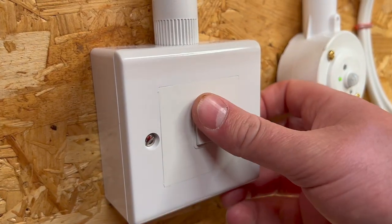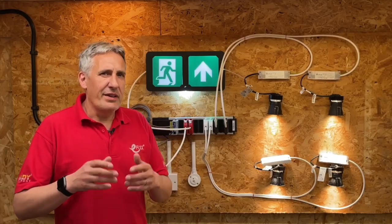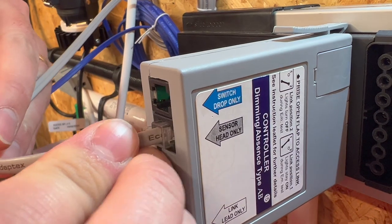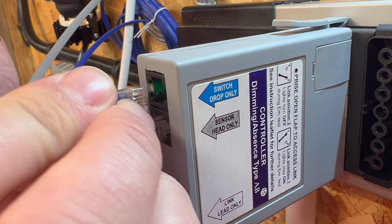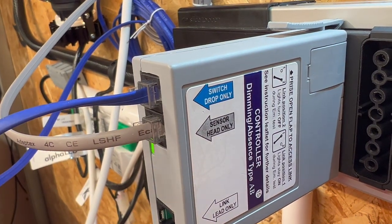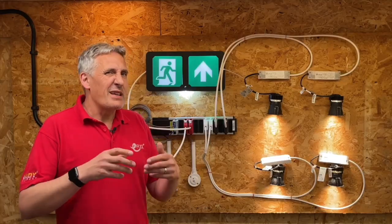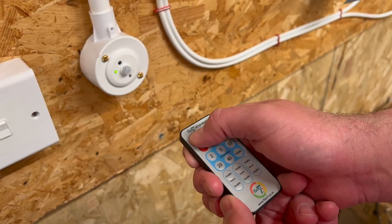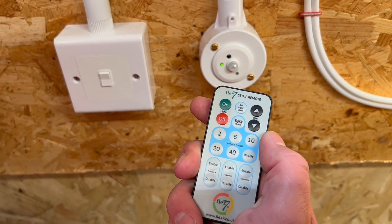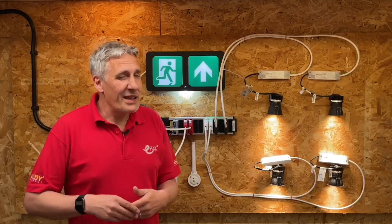The system is completed with a wall switch which can be used to manually switch the lights on or off and adjust light levels. The control inputs are on a separate PELV — protected extra low voltage — wiring system, wired using a flat data cable and RJ11 data connectors. This makes installation simpler because we're all dealing with low voltage, and the control devices themselves are more compact, so you have less ceiling clutter. The system can be fine-tuned using an infrared remote control, which can adjust operating modes, light level functions, and timer functions.